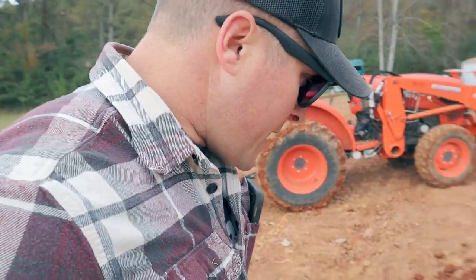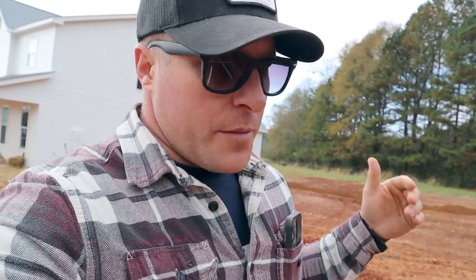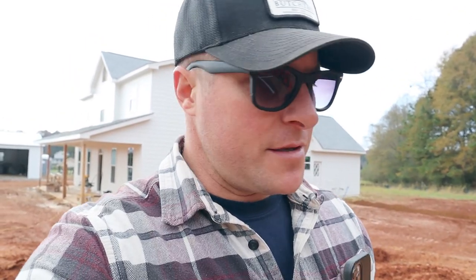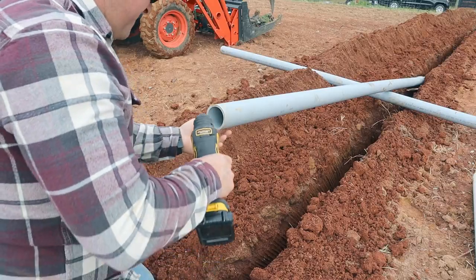And while I do that, I know there's gonna be a rough edge on the inside of the 2.5. So I'm gonna take my multi-tool and see if I can bevel that edge out nice and smooth on both sides of the 2.5-inch pipe where it's kind of floating on the 3-inch. That way the wires won't have any chance of getting chafed at all. I know that's probably not what you typically do, but we are trying to get this done. And I figured, what's the worst that can happen, right? They used to direct bury all this cable anyway. So that's the plan.